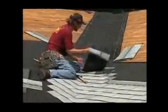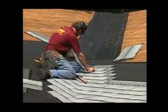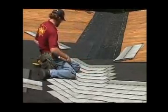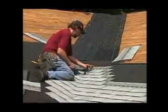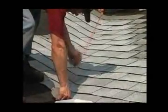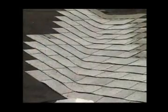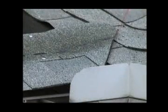Secure the shingles at the valley using normal nailing methods, but make sure there are no nails within 6 inches of the valley line. 2 nails should be placed at the end of each shingle that crosses the valley. Continue to apply succeeding courses in the same manner. Now, snap a chalk line 2 inches from the center line of the top of the valley on the unshingled side. It should get wider at the bottom of the valley, 1/8 of an inch per foot. This increased width will accommodate the increasing volume of water directed into the valley.